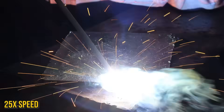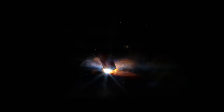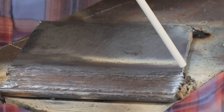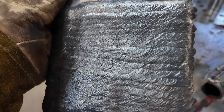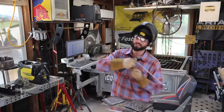The only thing I'll tell them is you need to focus on overlapping welds. Weld your first bead very straight, as straight as you can, and then overlap the weld with your next bead — aiming for the toe of your weld, the edge of it, and covering the previously laid weld at least halfway to the highest point or the crown of that weld. We simply want to overlap each weld very intentionally, very uniformly. I could put so many more welds on a piece of material and once I get all the way across, go back the other direction.